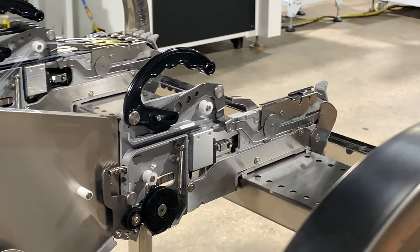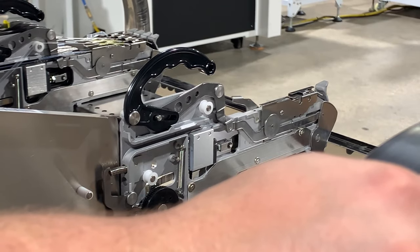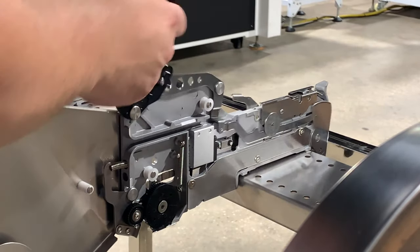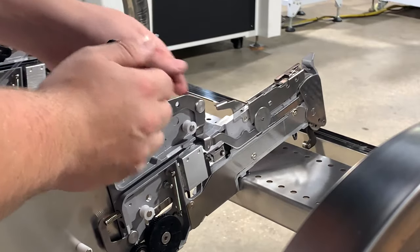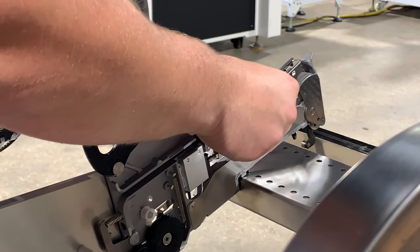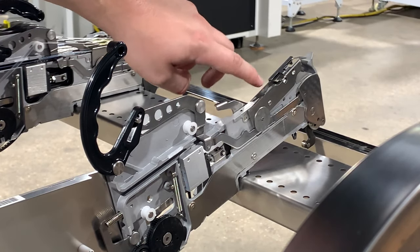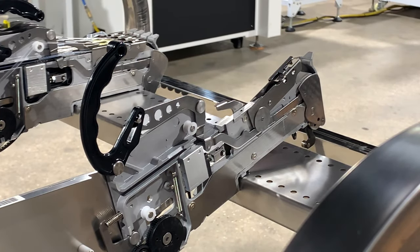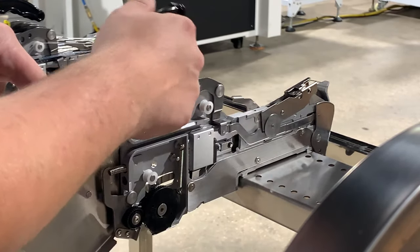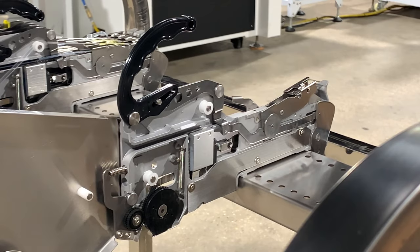The first thing we're going to want to do is get our feeder set up for this procedure. I have this nice feeder cart set up — you can do this on a benchtop or on the machine, whatever works for you. First we're going to unlock our feeder from the rail. We're going to press this lever down about halfway, which normally you use to advance the tape. Then we're going to press this part down as well and release the advance lever. This allows us ample space to feed the tape into the feeder. We're then going to lock the feeder down as much as we can — you can see here we are prevented while this is up from fully locking it in. Let's make sure that the machine can't contact the feeder on accident.